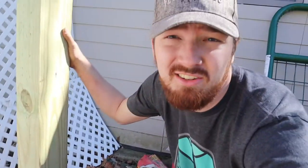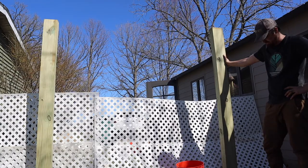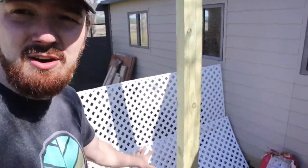The concrete is now sitting and hardening — that's going to take about 30 minutes, so this is where it helps to have something to hold the posts up. All you have to do is dump that dry mix of concrete in the hole, pour some water on it, and let it set. The post and cement have now hardened and are ready to go. I'm going to fill the rest of the hole with dirt to bring it level with the ground. You can't put major weight on it for about six hours, so since it's around four o'clock, we'll finish up tomorrow.